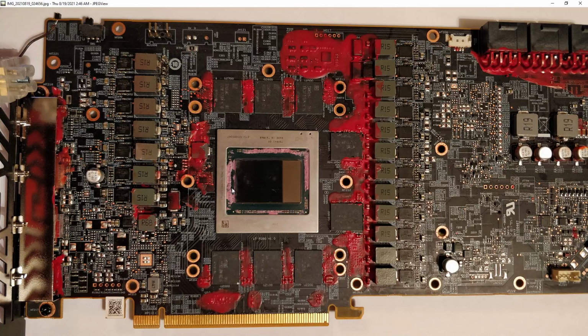It doesn't power all the way up to 0.9. I think probably like 0.7 or something. But anyway, sitting in Windows, the card will drop all the way down to 0 volts on VCore, then power back up. And if it's doing that with just one phase, that's got to be putting a lot of stress on that poor power stage.